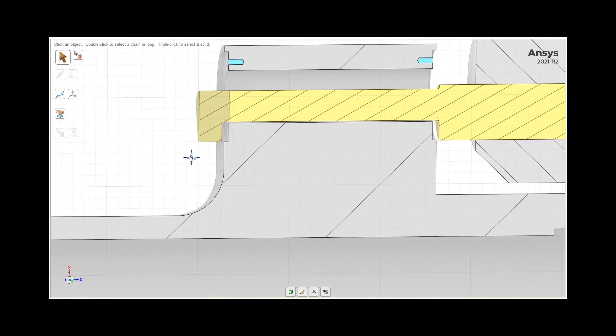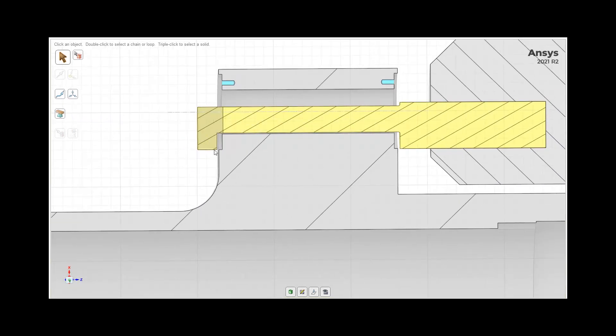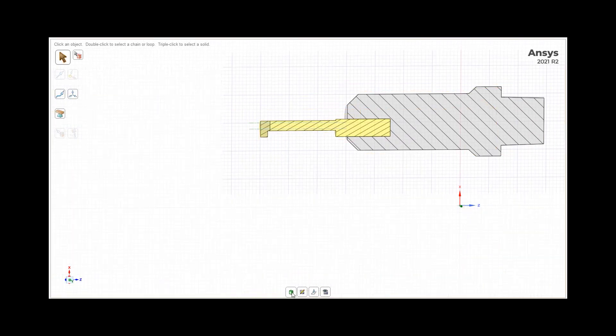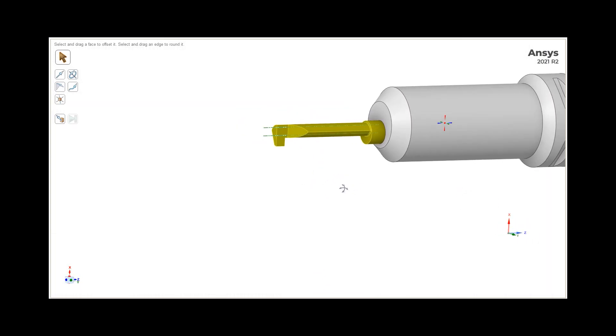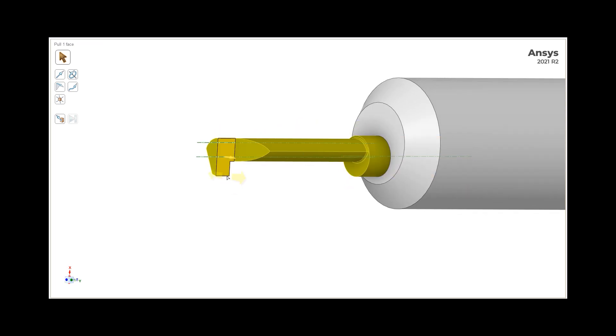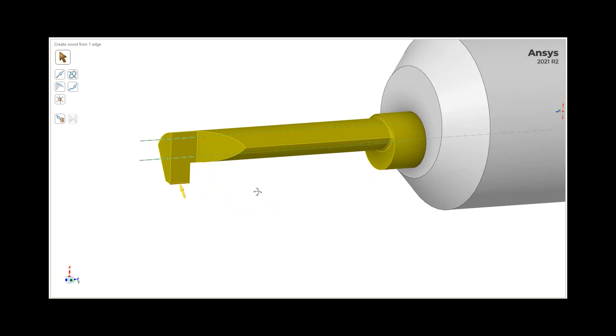You cannot back up with the spindle turned on because you're going to hit the face on the bore. You back up until you have clearance on both sides — on the cutting edge and the back of the tool — then move out of the hole. You cannot run the spindle and push the tool into the hole, because you'll just cut that hole out to the size of the counterbore. The 5/8 carbide blank has to be mounted in the tool holder such that the cutting edge runs at 1.015 inches radius from the center line — that's critical to cut the right size.